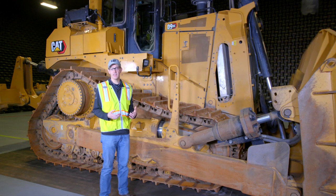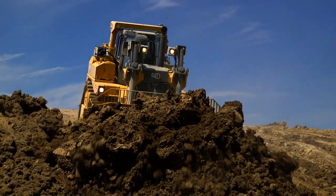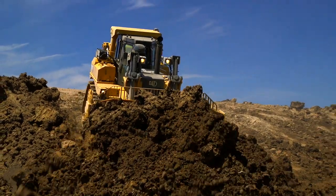We've now added a secondary retention on the bottom guards, giving it about 40 millimeters of travel in the case where the technician has to pry the belly pan down, improving the safety and serviceability of the dozer. This will pay customers for years to come as long as they own the dozer.